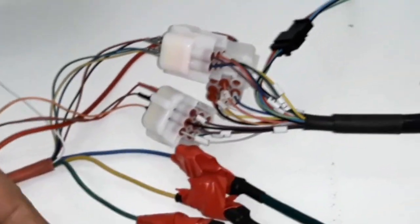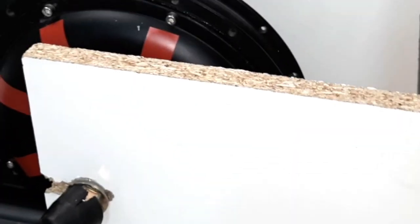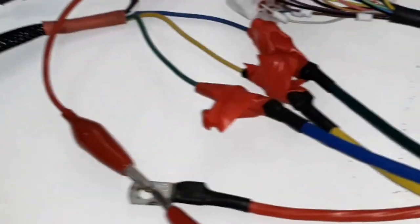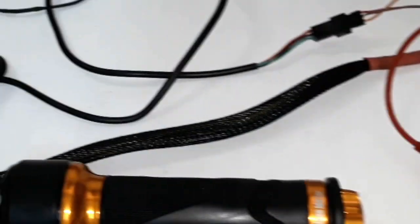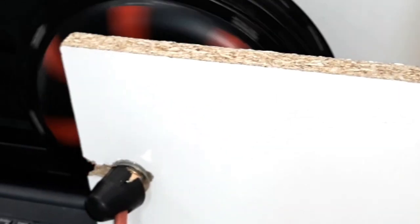What we have to do is check that the motor turns. I have activated the controller. It doesn't matter if the motor turns clockwise or anti-clockwise — it just has to turn. It is important that this first time you run the motor you do not accelerate full, just only a little bit, just to check that it turns.